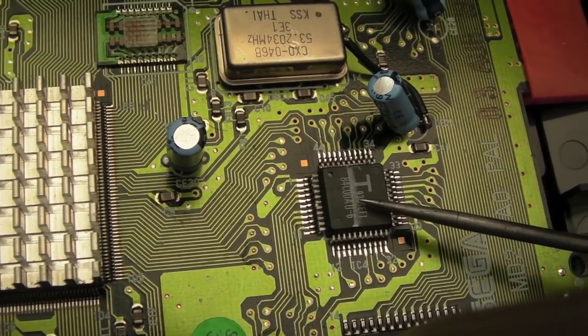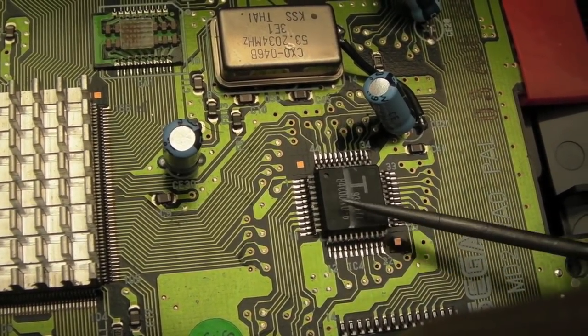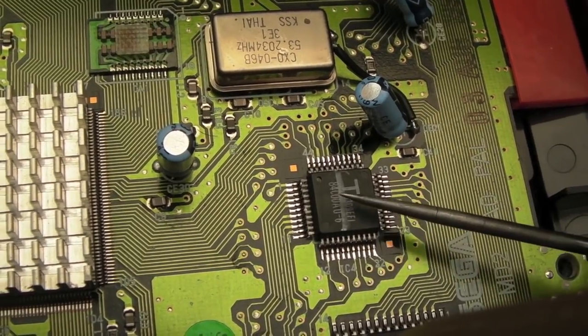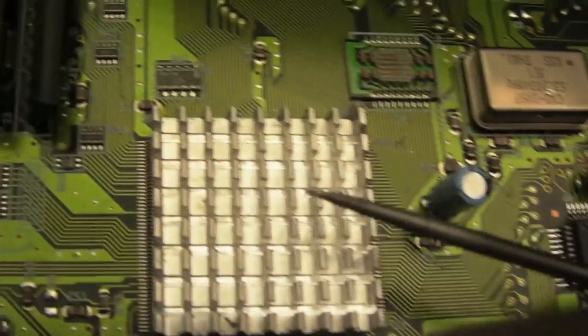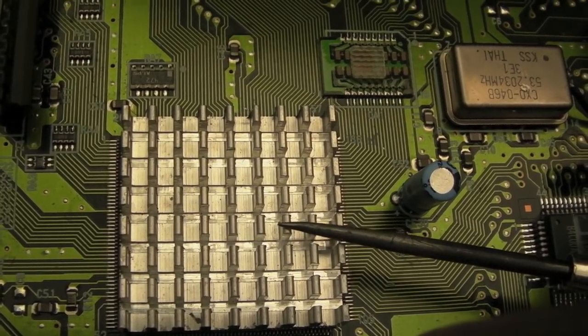And the way they've done it is, coming back to my comment earlier about this being a kind of baby Neo Geo in my mind, there are some similarities. The Z80 is used for the sound in the Mega Drive. So that's how they've utilised this, that would be the primary CPU. And it's a similar thing with the sound. I think you've got the sound functionality, and in this particular one, the sound is probably on board this ASIC here.